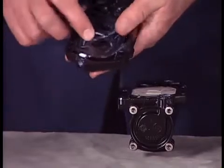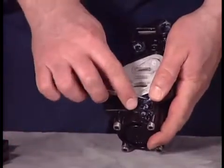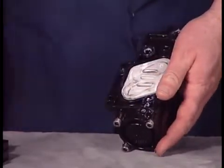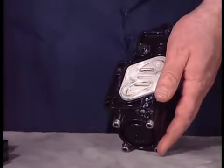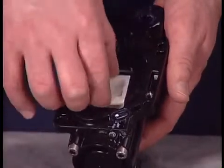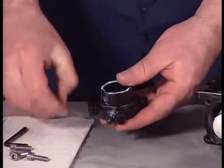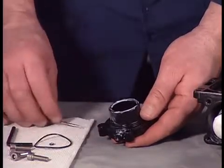This allows you to separate the plate from the valve housing. Use the pick to remove the O-rings and track gaskets from between the plate and housing. If the valve plate did not fall free, remove it from the housing. Now remove the valve insert from the housing. Use the 5-millimeter Allen wrench to remove the four screws from the bottom of the housing plug, then separate the plug from the valve housing. Use the pick to remove the O-rings from the plug.